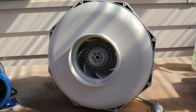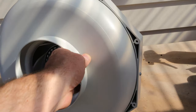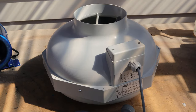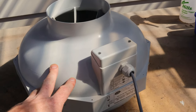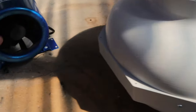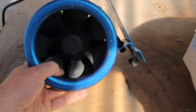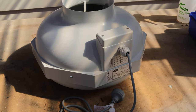The reason the new fan is so big is because it can handle back pressure and maintains its efficiency when pushing air through things like a panel filter or a one-way valve. Second, it's plastic — plastic resists moisture condensation better because it's pumping air out of a high-humidity room. Metal sits colder and humidity condenses on it more easily. Third, the electronics are situated on the outside of the fan, whereas on my last fan the electronics were literally sitting right in the middle of where all the air pushes through, making them subject to a lot of water. Electronics on the outside should be a huge decrease in the risk of water ingressing and shorting the fan out.